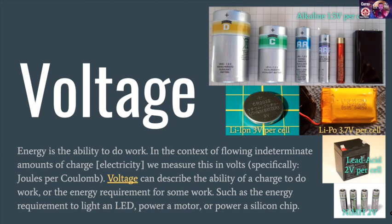But that voltage supply is what gives you the power to do what you're going to do. And there's lots of different ways that you can supply voltage, that you can supply power. But thinking about what it is and knowing that number for whatever you're working on, does it need 5 volts? Am I getting 6 volts? Just being aware of it is useful so that you don't get wildly off track and have something that needs 24, but you're only giving it 5, or can only handle 5 and you're trying to give it 48 volts. So just keeping in mind that they're all in the right scale can be really helpful. Although you can definitely go deep into the weeds with all of this.